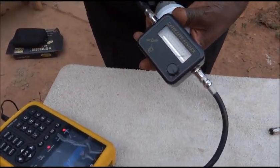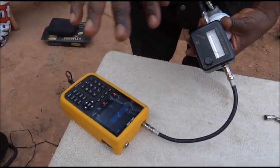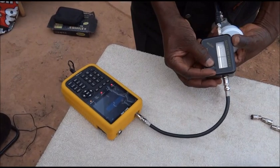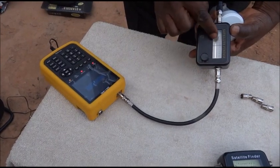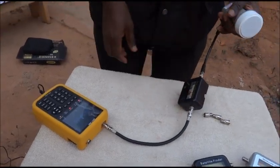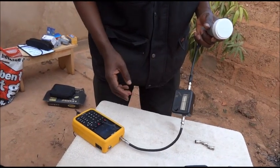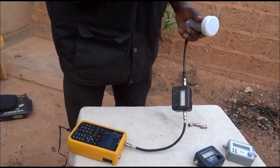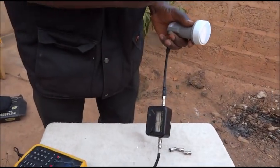This can be very tricky when you are trying to find the satellites, so one has to be careful. According to the manual of this apparatus, I reduce the volume down to a level of 5, and you hear this small sharp sound. Now the LNB is connected to it. If you put your hand in front, you can see a change in the amplitude of the signal, and the sound will tell you as well.